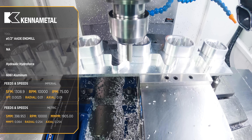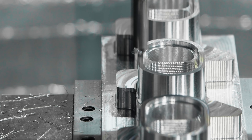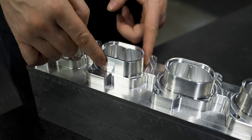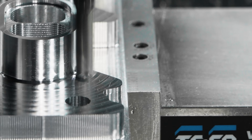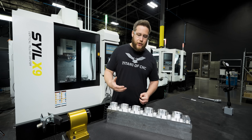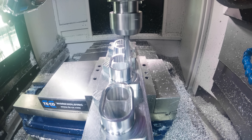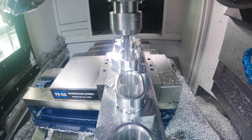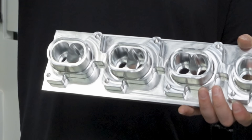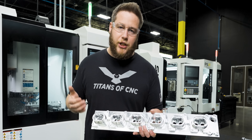Now we're going to come in with a half-inch end mill and start finishing the outside of the part. This is the same tool we used on the base flange — a half-inch end mill with a 60 thou corner radius — and it's going to finish the floor all the way around the part and then finish the outside walls of these bosses. Next it's going to call another half-inch end mill with a sharp square corner to come in and do these counter bores. The counter bores are just so the tubing that Nolan purchased will fit down inside so he can weld it up on both ends — it welds to this counter bore, and the base flange has the same counter bore so the tubing welds to both ends. We had to change to a different end mill because it needs a sharp corner in here.